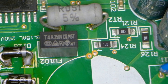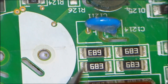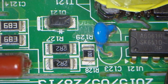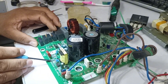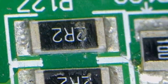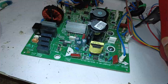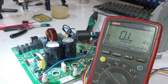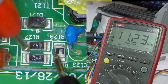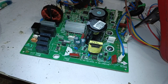I have tested all the resistors and they are almost all in good condition. I'll directly point out the fault in this circuit — when you check the resistors, one of them might come out faulty, or there might be a faulty diode connected to it. I had already changed the switching IC, but the previous technician did not check these resistors. By looking through this microscopic camera, I found one resistor is burnt, and you can also see another burnt spot on a second resistor. The multimeter in ohms mode is showing 11.14 mega ohms of resistance — both resistors show the same value because they are connected in parallel. Because of this, the SMPS wasn't fixed.